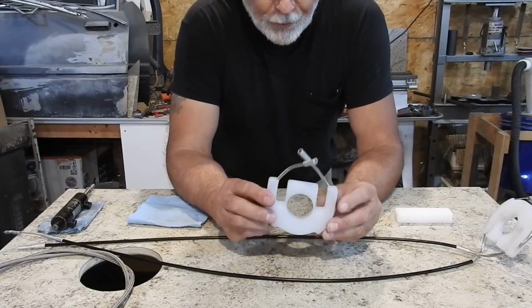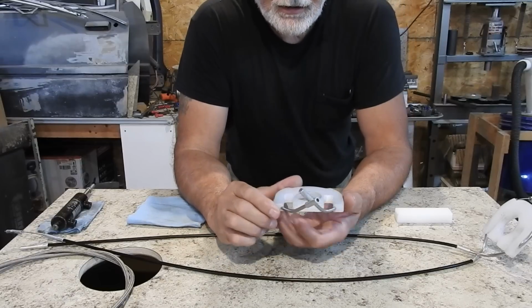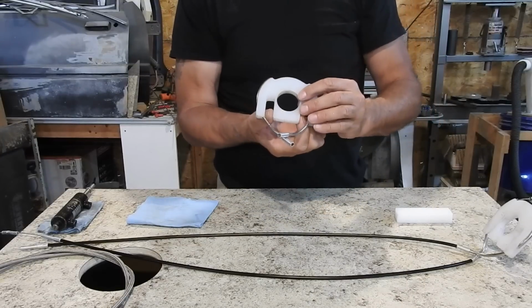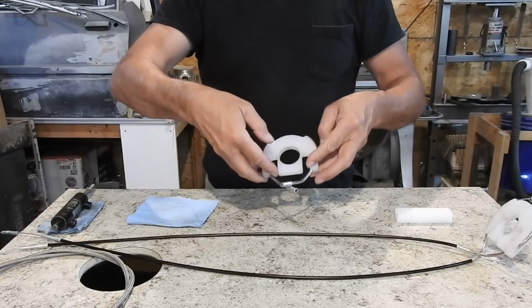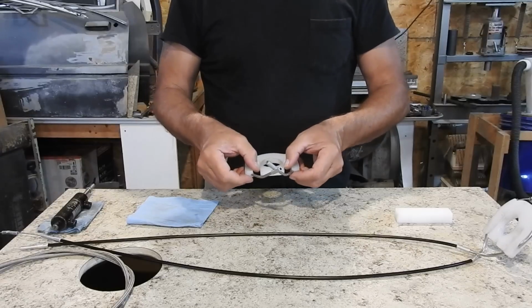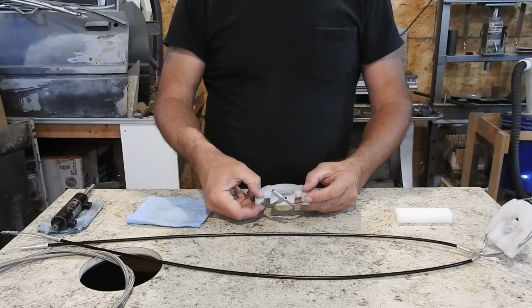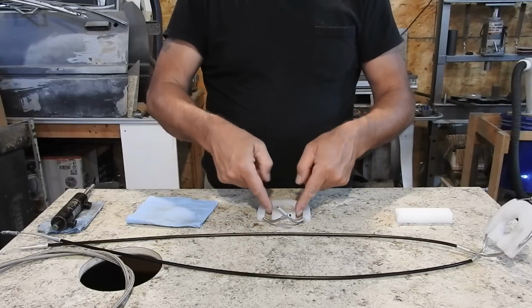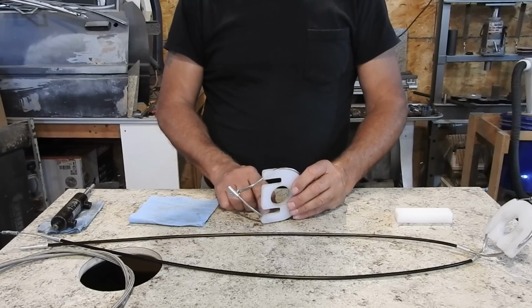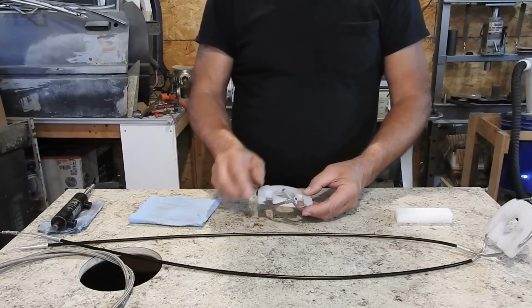Okay, this was version 1.0. This was the very first one I made, and that's the one you saw on the tailwheel assembly right here on this bench. And the problem with this one was I made this width here, the center of this, the width of the tailwheel assembly itself. And then the retract linkages, rods that come down and grab the wheel, that's what these grooves are for, they're 1/2 inch square tubing. And so I made it to this width and just made these 1/2 inch. Well, when I took this down there Saturday to put it in, it was too narrow out here. These forks were farther apart than I had allowed for. So I had to come in, bring it back home Sunday, and grind all this out to get this in there to work. And, it was still Saturday. I worked on this beginning of the last week, it was.